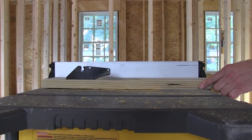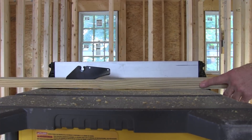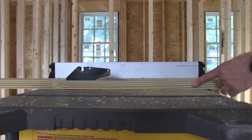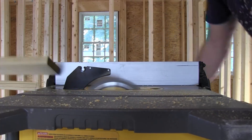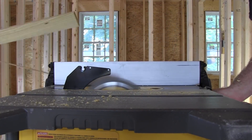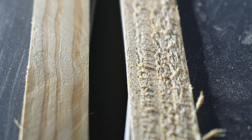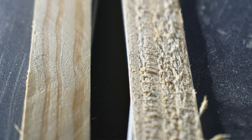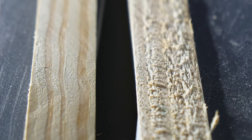The other thing that was different is we used the DeWalt FlexVolt blade that comes with the saw — it's optimized for the saw, DeWalt recommended it, and they sent it with the battery. Some of you commented we should have used it from the beginning. On the original 9 amp hour versus Milwaukee 12 amp hour test, we used two identical Milwaukee 24-tooth framing blades. If you look at the photo, the left is the Milwaukee saw blade rip and the right is the DeWalt FlexVolt rip. Clearly the Milwaukee blade has a high alternate tooth bevel, an ATB pattern, which made a smoother cut — no doubt.